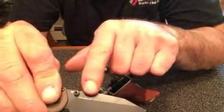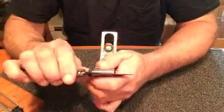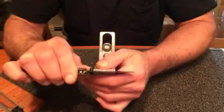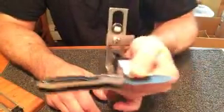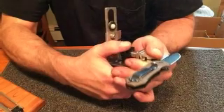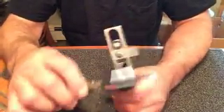There's just a little bit of flat land over here — I'd like to have at least one corner of the clamp on that. It's not absolutely necessary but it helps, pretty close to that thumb stud. I'm lining it up from my view — same thing, I have it where I want it. Pinch the very front jaws, get those jaws to align to that blade shape, snug, then drop your hand back and tighten. That's it — it's in there and it's centered. You'll have the same angle on both sides.